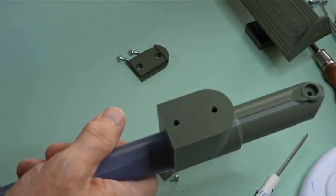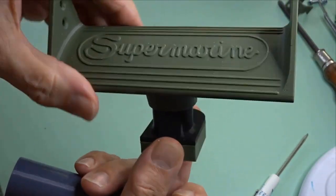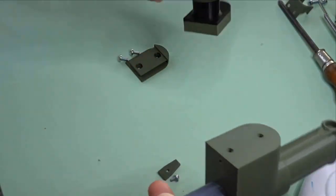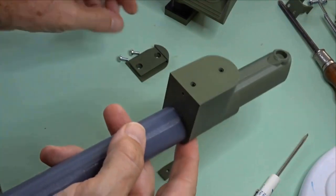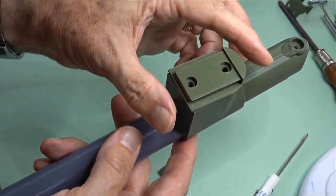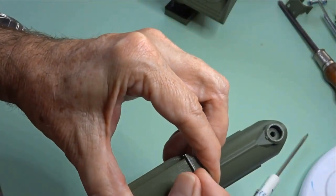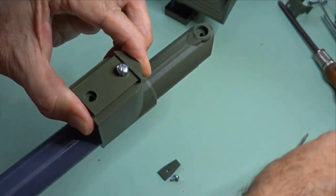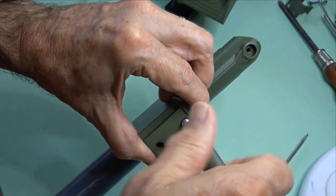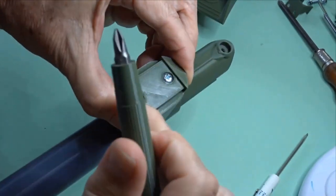What we're more interested in are the, I'll show the assembly of these in a separate video, but these pedals here, which are the Mk1 Spitfire pedals, and they have a system for putting them on that makes them fairly adaptable. Okay, we've got these dovetail fittings. We have the M4 8mm button head screws, and they will go in like that. So that, as long as they sit under that level.